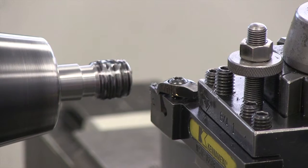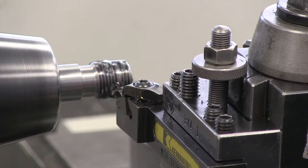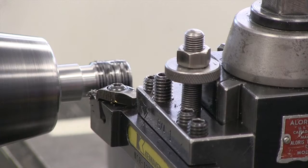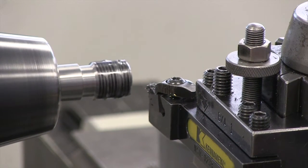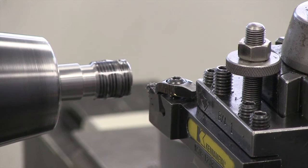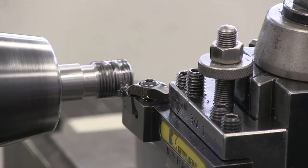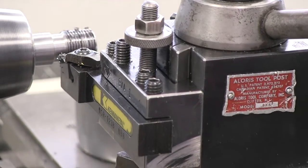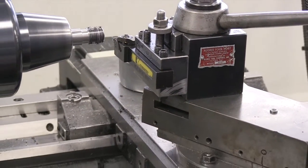I'm going to engage this time on the three. Starting to take a little bigger cut. Knowing that I'm going to move my compound rest to about forty-four thousandths, I know where I'm headed so I'm not worried about that. Right now I am at sixteen thousandths on the compound rest.